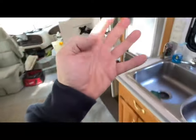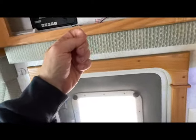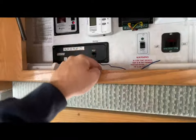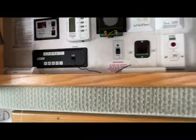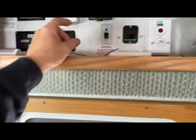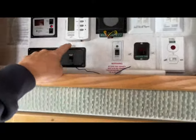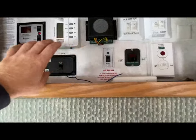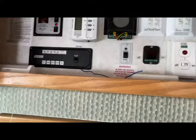The wiring is very easy — there are four wires you connect. There are two black wires which are the grounds; you just put those together. All I did was take this panel out. The switch basically just has a wire coming in and a wire going out — one is power and the other goes to the pump to activate it. Take the two black wires, put them together, and connect them to any ground behind the panel.